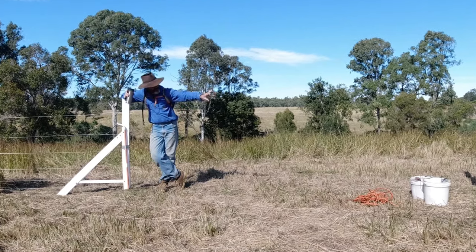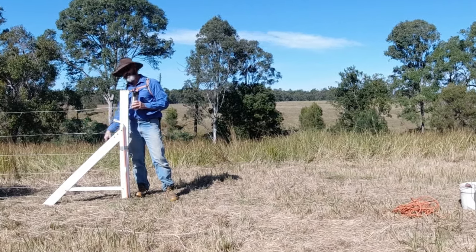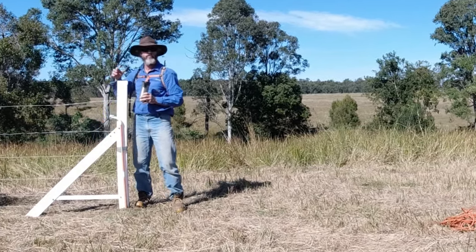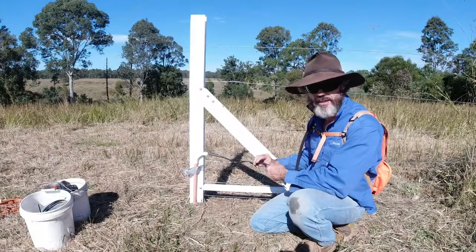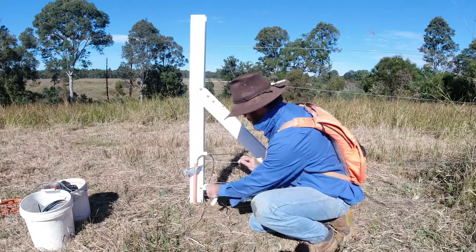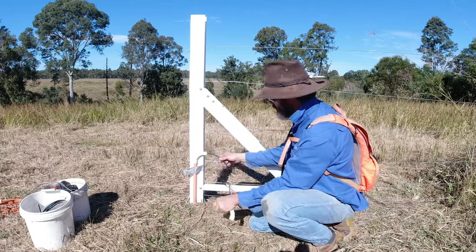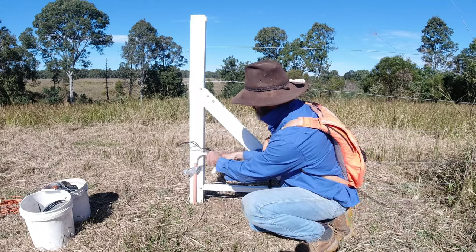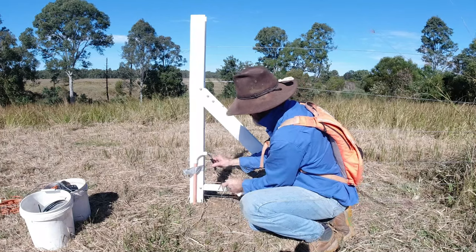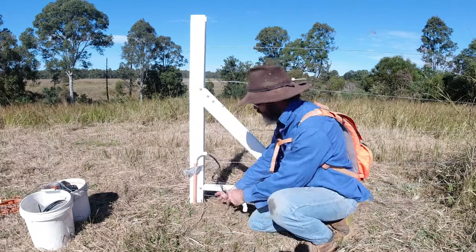One's going to be an earth and one's going to be a hot wire. So to move the conductivity from that side to this side we need to put our hot wires or jumper wires down our six strands. What we're going to do today is I'm going to show you how I go about and draw a jumper wire all the way down. The bottom is going to be an earth. You can see I've left my cables pretty long. The reason I've done that is one's obviously going down to earth which is that bottom wire and the other one I'm going to route up to that wire and then jump them from there. Any excess cable I'm just going to fold up and loop it around there. I want to put a zip tie on that cable. The reason being is if I ever damaged that earth strap with a whippersnipper I can just take that loop out and I've got more loop to go down the bottom.